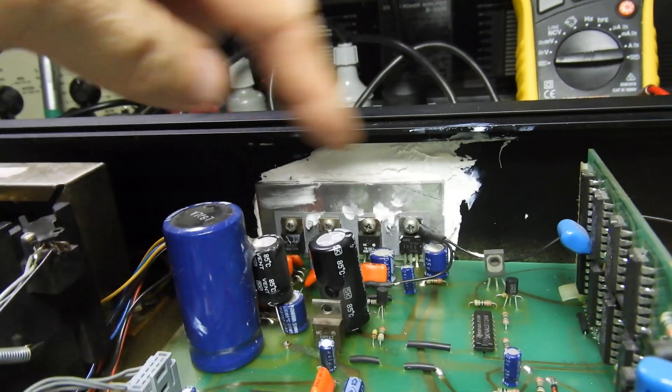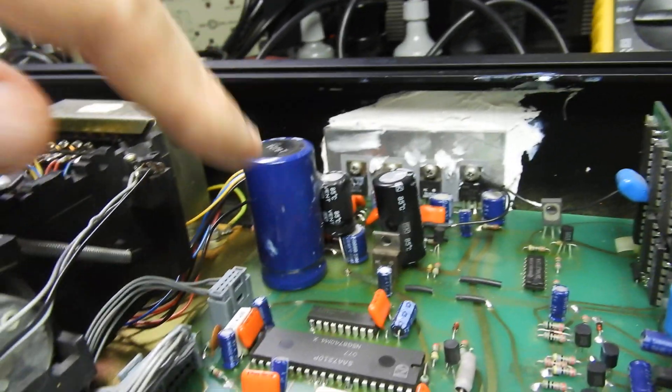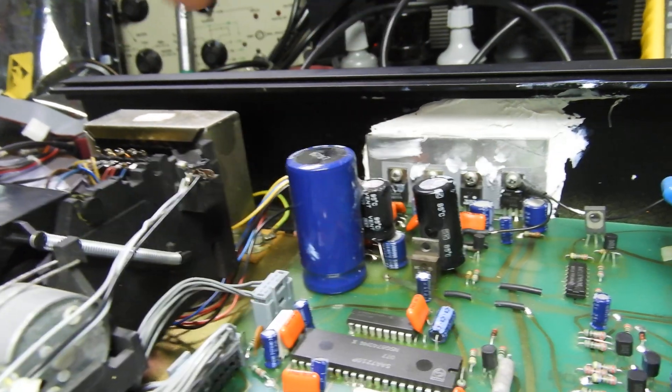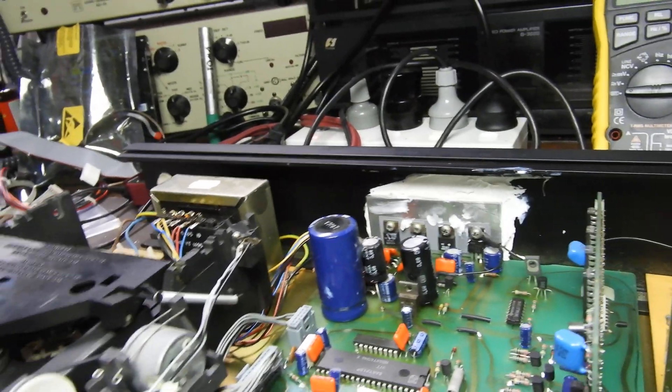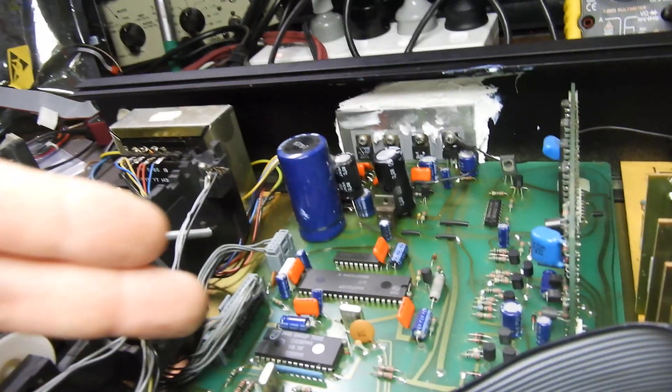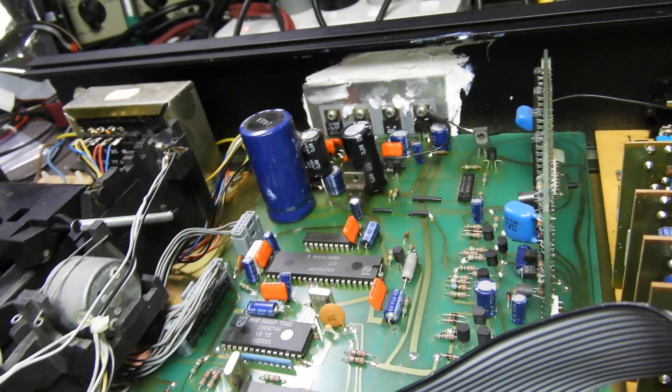Those four regulators have been checked for voltages — they're fine, and the 51 as well. They also have the right voltage. We can see that the capacitors — this is certainly not standard work. The board, strangely, hasn't got any silk screening. It hasn't got any markings on it whatsoever.